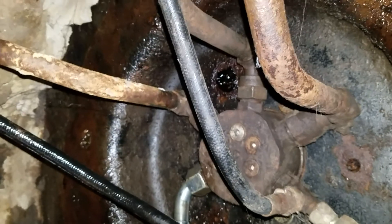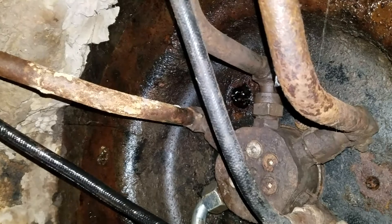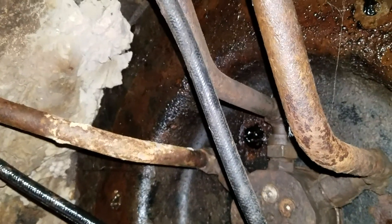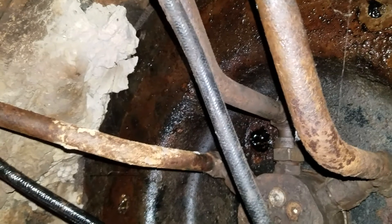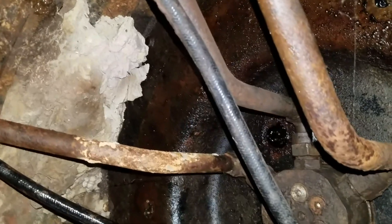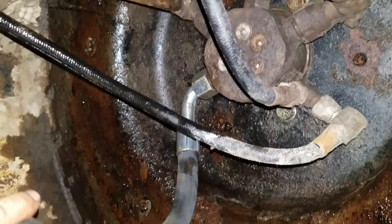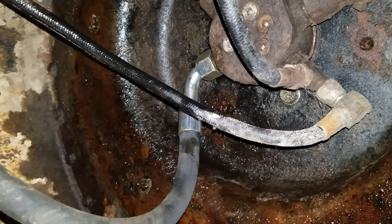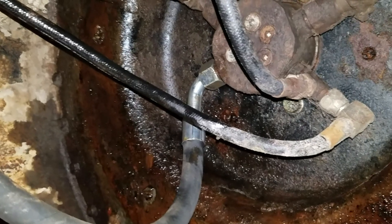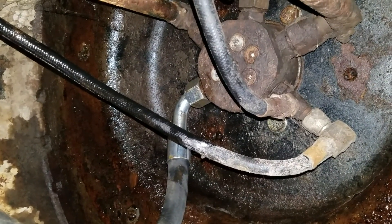This is not really a moving area right here — this is all stationary, so that should be just fine. Time for a pressure wash, get the covers back on, and keep it safe. That was a simple repair for your E70B. If one of your steel lines is leaking, just replace it with the braided steel hydraulic hose and you'll be good to go. Hope you guys enjoyed it — I'll catch you on the next how-to with any E70B repairs we do. Thanks for watching.